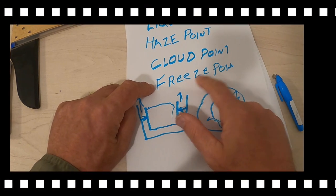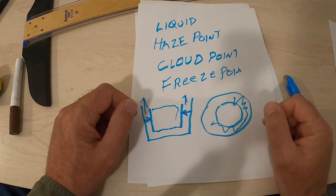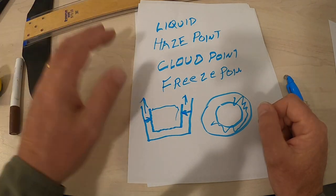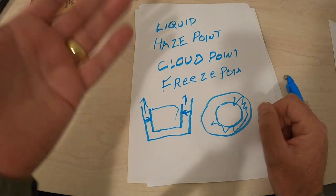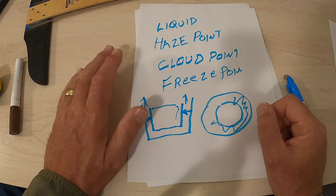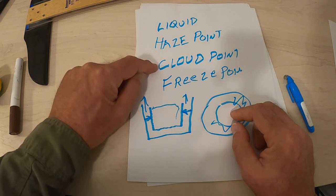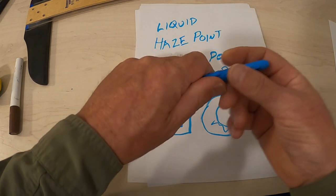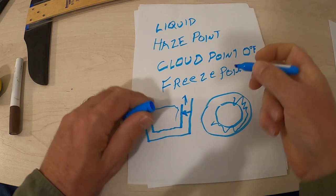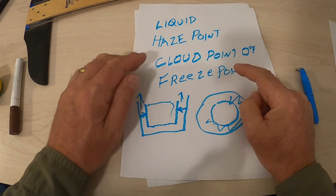This is what bursts. So you've seen a video, we played that video, of some antifreeze that I found that wasn't what it said it was. I mean, is it just pink water or something, or just a bad mix, or who knows what? But I want to show you now what the cloud point actually looks like. When you get down to around 0 degrees Fahrenheit, this should be a slush, not hard like the video showed, but an actual slush.